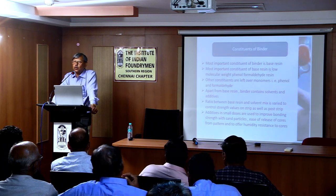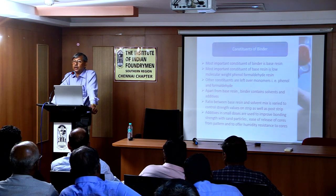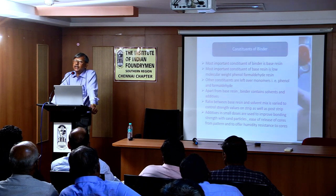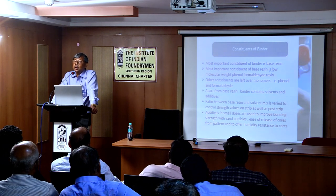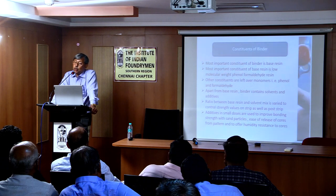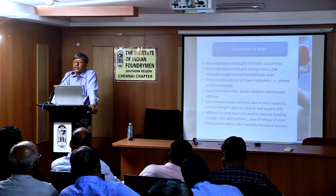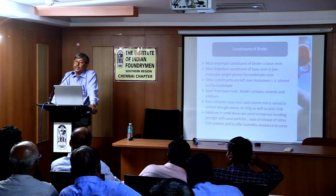I'll come back to that next. So in solvents, there are many. There are two categories called polar and non-polar. Polar solvents are esters and ketones of high boiling point, not low boiling point, because with low boiling point, once you mix it, it will immediately evaporate into vapor and the bench life will be reduced. So high boiling esters and ketones. Then non-polar solvents are aromatic solvents of high molecular weight, but aromatic solvent is slowly being reduced because you must have heard that on pouring, these aromatic solvents decompose to BTX, benzene, toluene, xylene, which are not good for health. These also have a lot of adverse effect on the atmosphere. So this is slowly being replaced by aliphatic solvents as well as biodiesels.